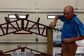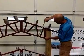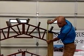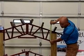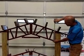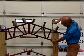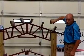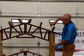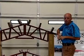So, our chord loss, okay? All right, since we have an 18-inch dimension here, you lose 4 inches here, okay? So you actually, your post loss is going to be 15 inches. I'm sorry, you have 18-inch. So you lose 4 inches, but because of the angle, you have another inch. So on our trusses that are 44 foot or less, you lose 15 inches here. You're going to lose 21 inches on the 46 wide to the 62 foot wide, and you're going to lose 26 inches from your 64 foot wide to your 80 foot wide trusses.